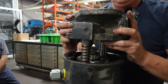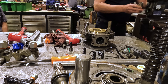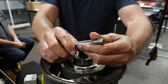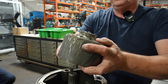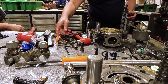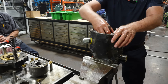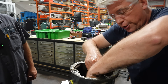Remove the port plate. There are the internals — this is the stroking piston, or control piston. Different companies call it different things. We always refer to this as the port end cover; I call it a port plate — it does the same thing, tomato tomato. This is the counter piston; we'll take a closer look and probably polish that up to see if it's reusable. Pull the pistons out, the retaining plate, retaining ball, and then the swash plate. After we pull the drive shaft out, we have our cradle shells and bearing liners — the last two pieces to come out.